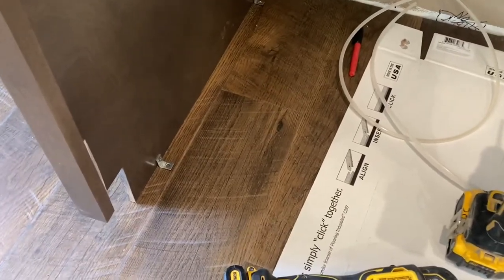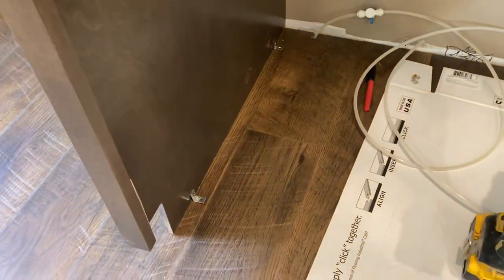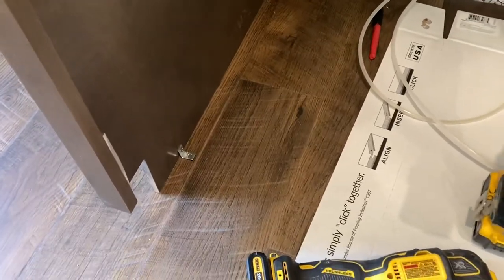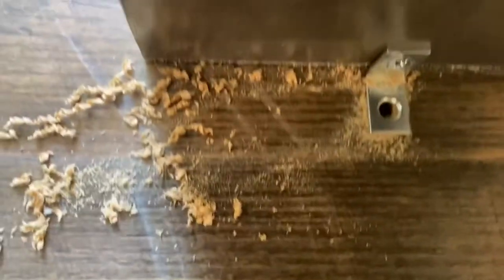Truthfully, I think the floor needs like a quarter inch or five-sixteenths spacing around the edge. We're not going to have that here, and most of the time five-sixteenths is going to be pretty hard to get anybody to go for, especially if you're using a three-eighths inch baseboard. So all you're going to do is take your drill, drill out the material only — you'll usually feel a little click once it goes through. The nice thing is we've got a quarter-inch hole there, and we're ready to rock and roll with the floor and get that screwed in.